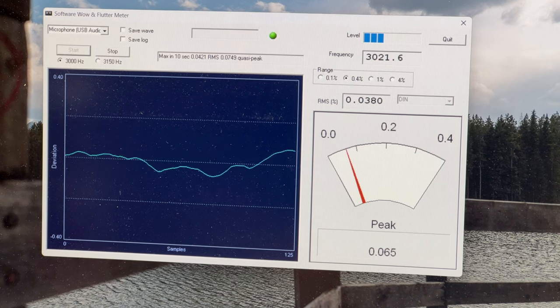But yeah, there's four in the playback chain that haven't been done yet, and there's two in the microphone input that haven't been done yet because they're tantalum. I wasn't sure whether or not I was going to bother replacing those, because I'm not going to use the microphone input. But yeah, I may go in with the electrolytics there. It's not really good to keep old tantalum capacitors around because they fail shorted, but I was really on the fence about that.